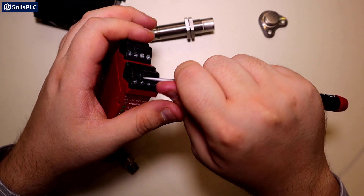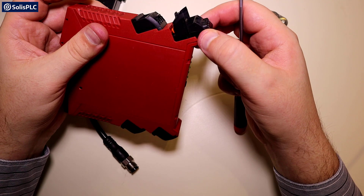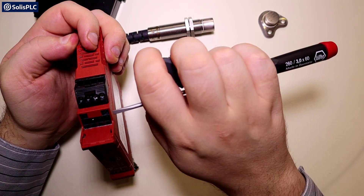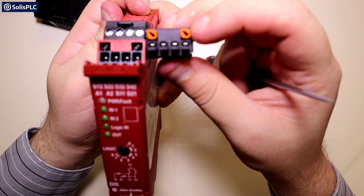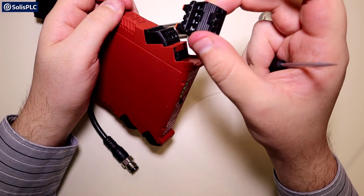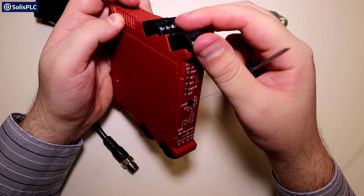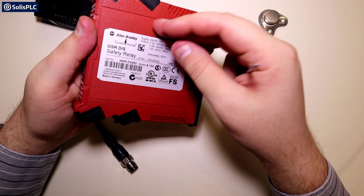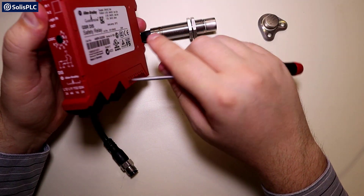The wiring on this relay is very neat. If you toggle these breakouts you can pull them up and the terminal connection will slide out, then slide back in once placed. There's also a locking and matching mechanism — two little orange notches match with notches on the module, so you cannot insert the wired module into the wrong side. You can pre-wire the module in the field before installation, which wasn't possible with the older one. That older design was a very tedious task to troubleshoot, since quite a few wires come from both the top and bottom.